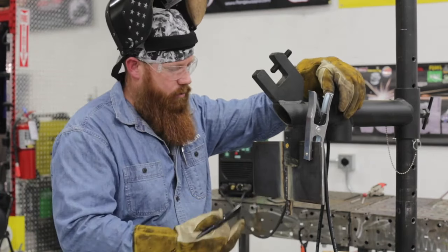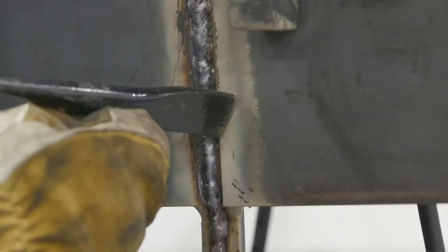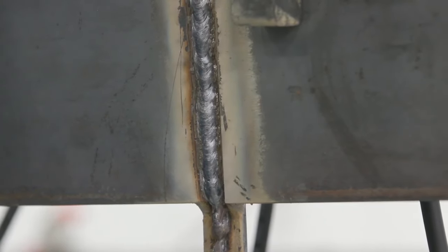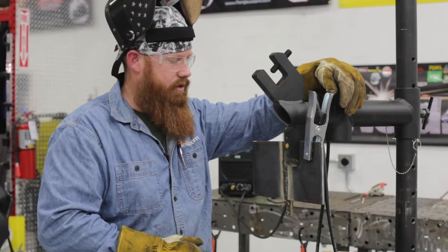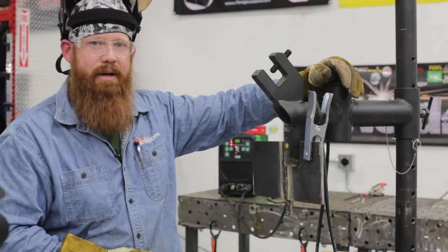So when I go to put my fourth weld in, I'm going to do the same thing. I'm going to make sure I'm about 1/16 below the top of this plate, and I'm going to tie into the weld that I just put in there roughly 50%. So with this one, with any luck, I shouldn't have to do any start and stops either. And then we'll go ahead from there. I'm just about flush. We'll probably go ahead and start running the cap after that.